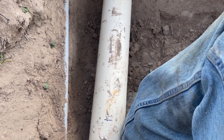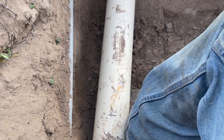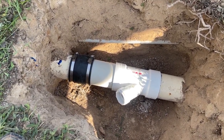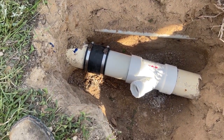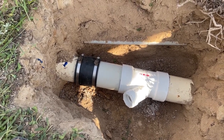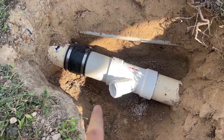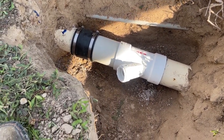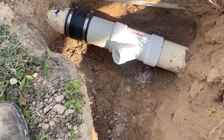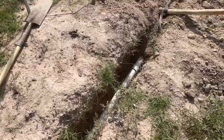There's probably water running through this right now — the washing machine, dishwasher, everything in the house is probably running — but we're gonna cut it out real quick and cross our fingers. That's done. The gap despite my best efforts to measure was close to three inches, but it reached. Luckily I didn't have to buy a six inch coupling — that coupling's only four inches, so you really do have to cut it close. Now I'm waiting because I don't have an inch and a half sweep — my neighbor's at the store picking one up for me.